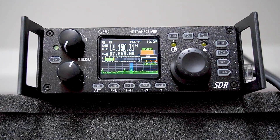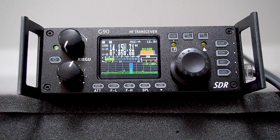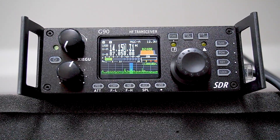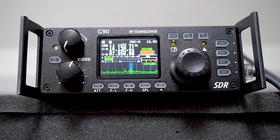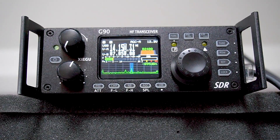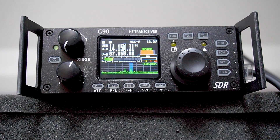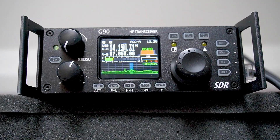You'll see the VSWR curve I showed before without the ATU. Even with a modest VSWR, the loss on the coax cable is minimal. I'm going to put at the bottom of this video a little link to a calculator so you can calculate what the coax loss is on the length and type of coax you use at a given frequency. I think you'll be very surprised at the loss — it's very, very small indeed for a mobile setup, even with something like RG58.